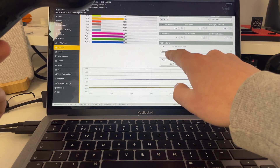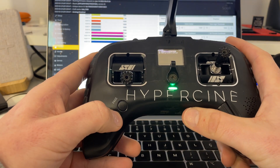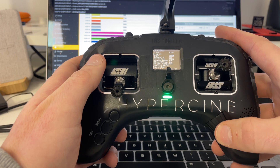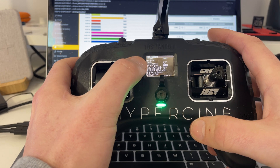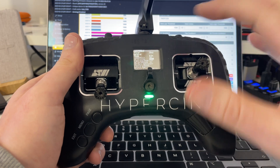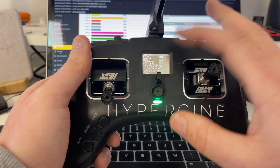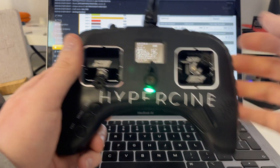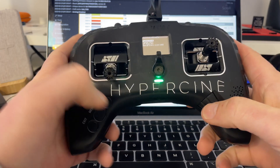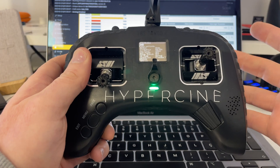This is what I do on all my drones: set the cutoff point type to manual 15. Then go to the Crossfire menu, go to the nano RX, and go down to RF profile. It can be dynamic, 150, or 50 — put it on 50. You get a little bit less range but you get better latency and it's always consistent. Also, on the power setting, leave this at 25 — do not change it. Some people think that's where you set the transmit power, but this is the power for telemetry — things coming from your drone back to your remote. Leave it at 25. If you want to set the actual transmit power, that's here. I run region open, 868 MHz, and 100 milliwatts — I don't need more.